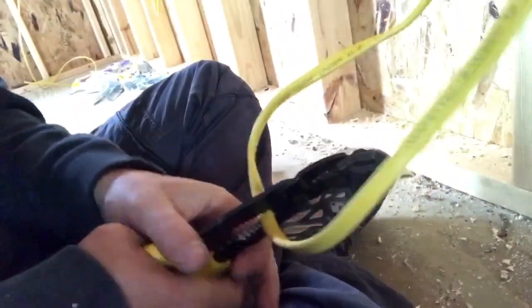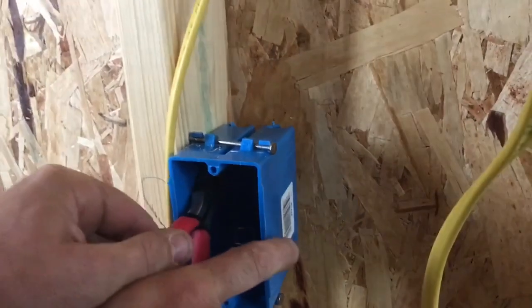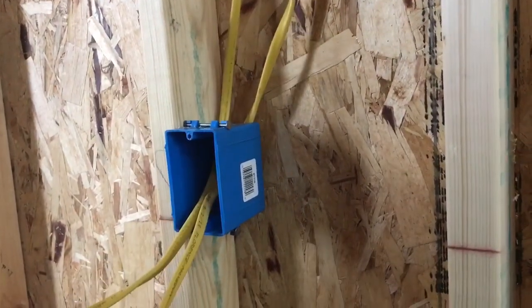We've got three outlets over here and we're going to show how we're doing this run on this circuit. We've got the wire pulled and we're coming in right here — we've left extra. I have this loop and I'm simply going to cut it here, and this is the part that will go into the box. We take our wire cutter and cut that, then bring one of the wires in through the back of the box — these are just tabs you punch out. That wire coming in is the one from our power source, which will be the generator.